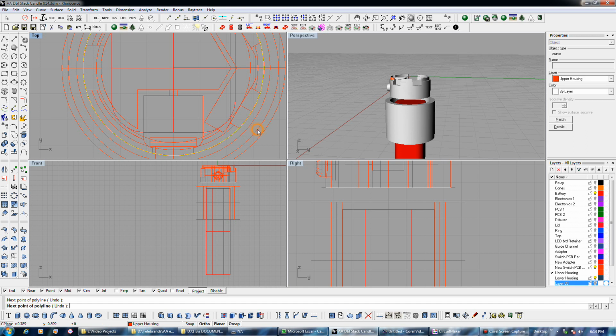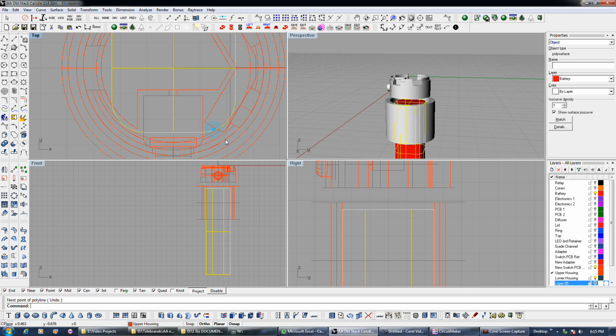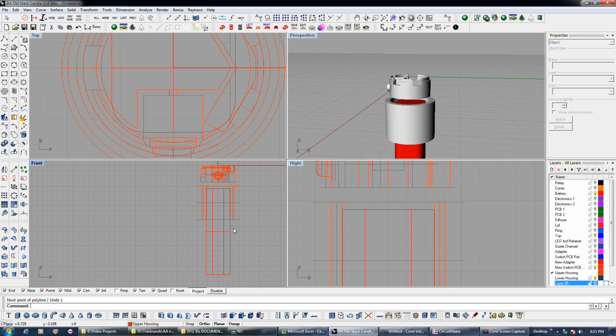that's only about 81 mil, and you subtract at least 25 or 30 mil just to have some tolerance on the 3D printed parts, it only leaves you a 50 mil thread. I'm not sure 50 mil is going to be strong enough or good enough to hold this in. So I'm a little skeptical about that. Now, I could have the wall jaunt in a little bit, eating up some of our battery room, but I'd rather not do that in the lower half of this.